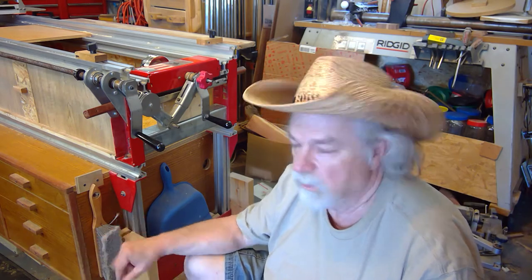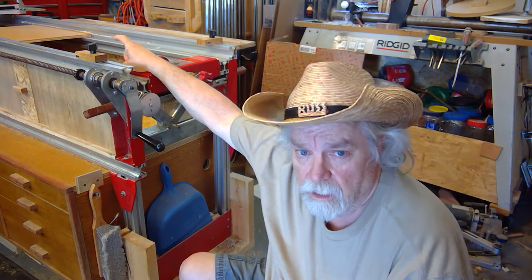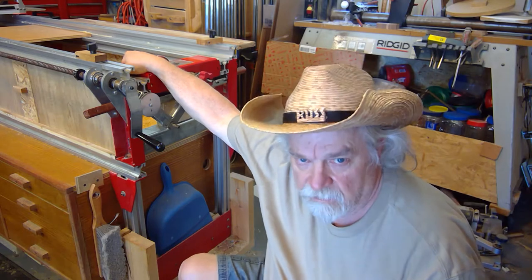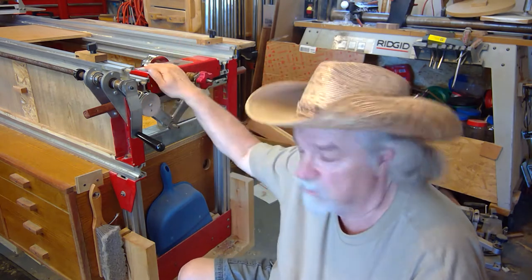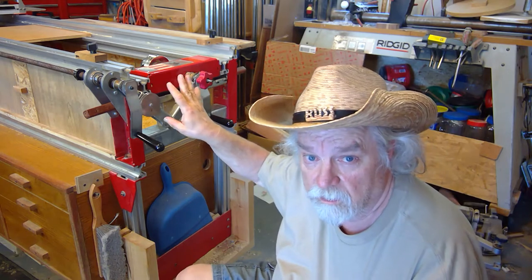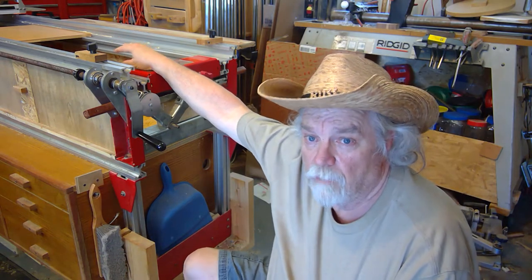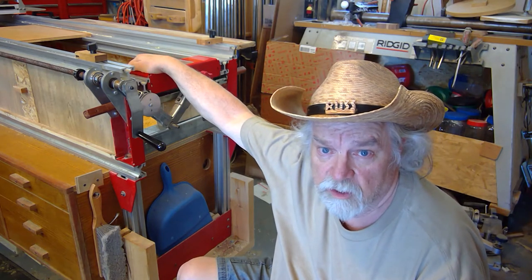It's like building a better jig to do the same thing — different jigs, some work better than others. I've worked to make this machine better, just like the z-axis control I already showed you. That didn't enhance the capability of the z-axis, it just made it easier to control. That's the theory behind what I'm trying to show you, because eventually once I show you the basics of what makes this machine work, we can start building one of our own — basically an overhead router controlling the X, Y, and Z axes just like a CNC machine.